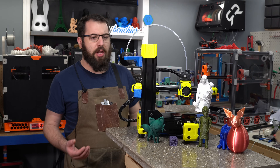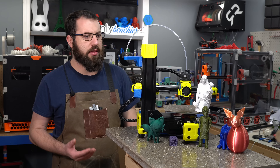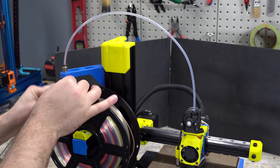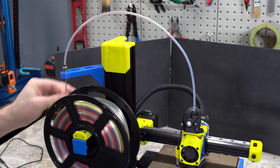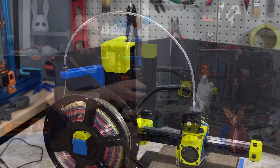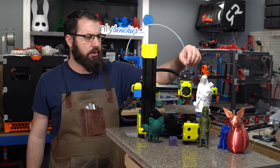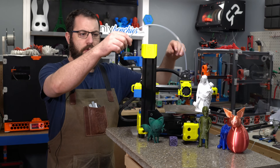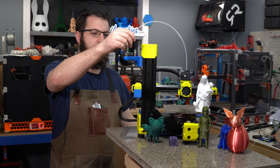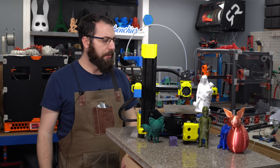When it comes to the mechanicals of the printer, I built it pretty much stock. I didn't really change too much of the original specifications and design of the printer in that regard. The only thing I really added was a community mod for a reverse feeder Bowden tube. The reason for that is in the original design, there's really nothing that connects the spool to the extruder — you put your spool of filament on and you have your extruder with a little feeder Bowden on it, but there's nothing really guiding it. I'll have this community mod linked as it makes a nice little feeder Bowden setup.